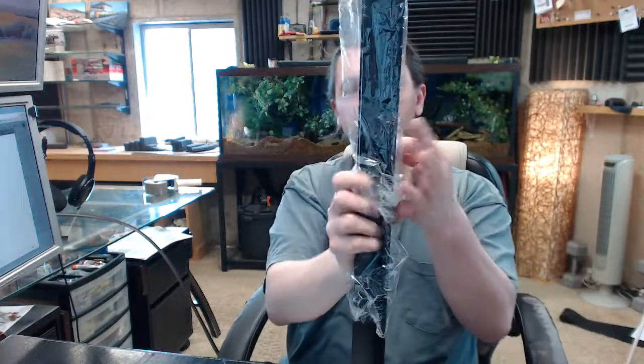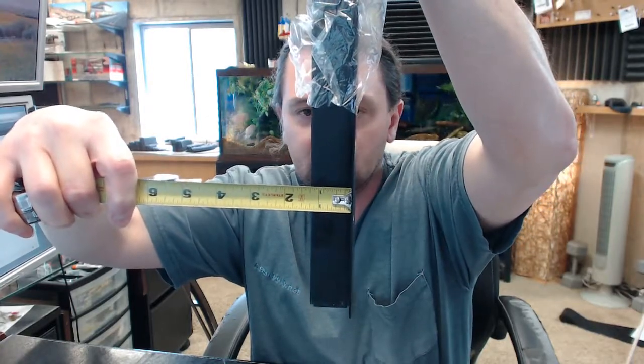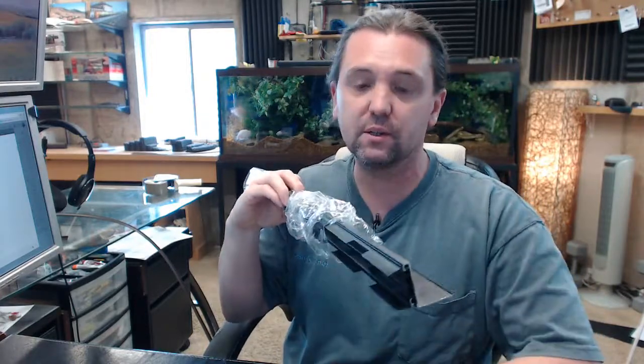You are going to want to be right in that 5/8" sort of undercut range for this to work well for you. This dimension shown is basically 1-9/32", so essentially an inch and a quarter, which means you will be able to get this installed even on an inch and three-eighths door. Nonetheless, you would be able to get this installed on the common 1-3/4" thickness or 1-3/8". This is going to be available in several different lengths as well and of course different finishes.